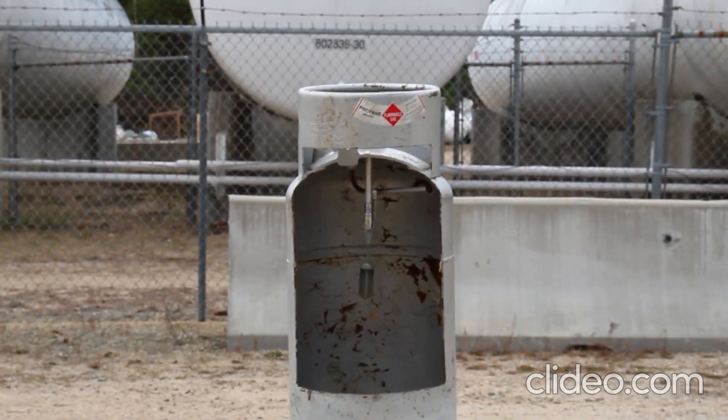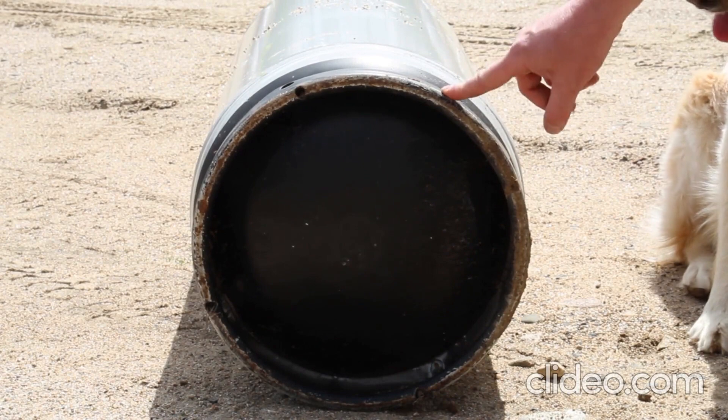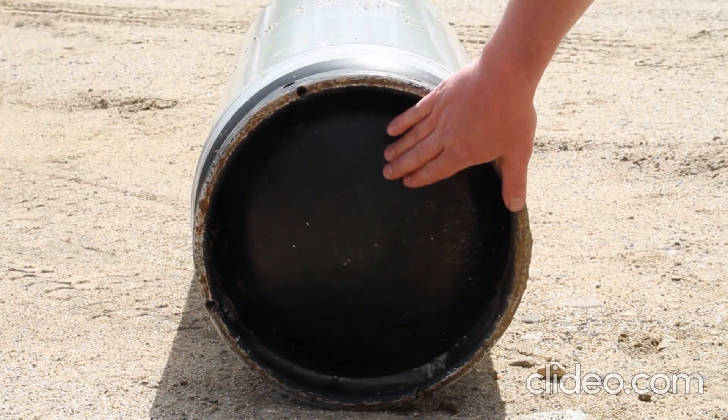Here's an example of a motor fuel cylinder cutaway so you can get an idea of what that looks like and the internal workings. For a hundred pound cylinder, please make sure you inspect the foot ring on this and all cylinders. Give a good look at the bottom — make sure that there's no excessive rust, pitting, or gouging on these cylinders and all cylinders.